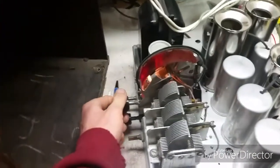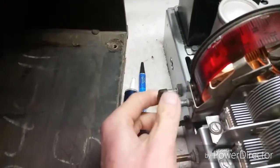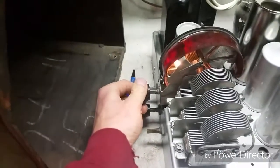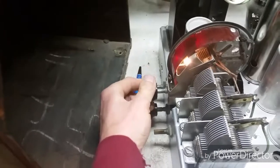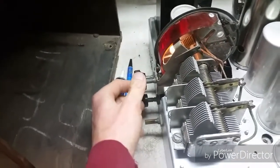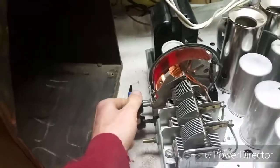Okay, well we're picking up the station here. Pretty noisy — I don't have the best antenna on here, it's just an old TV antenna going outside. It seems to die off as I tune it up the dial here still. That's what it's doing still. But this is just after I replaced those wires I showed you. If I could just get it to stop doing that I'd be really happy. I am getting a bit more volume out of it, so I think that thin wire was part of the problem with the volume because I was always getting really low volume out of this.